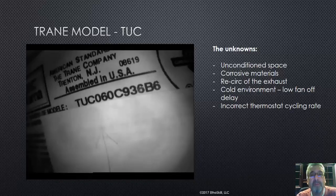Here's a scenario: let's say this furnace was removed and replaced with a new furnace. If the installing technicians connected it back up to the existing venting — they checked it, it had the right number of elbows, correct size and length — but they never checked the termination. Maybe the termination was up on the roof. If it's recirculating the exhaust, we could ruin another brand new furnace. That's why we show these videos so technicians can be good technicians.